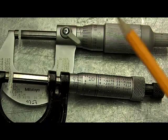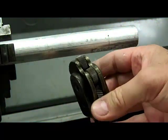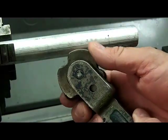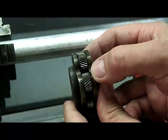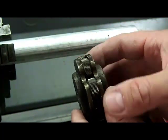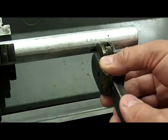You will also find this type of knurl on the outside of coins. I brought in a couple of knurling tools to show you, and it just grabs onto the tool post here. In this style, I actually have a set of articulating heads, so what it does is it centers itself on the shaft. These are the knurling wheels here, and this particular one has three different sets — a coarse knurling wheel, a medium knurling wheel, and a fine knurling wheel. The idea is it goes on the front of the shaft, and as the lathe turns and it feeds, it puts that pattern on the outside of the material.